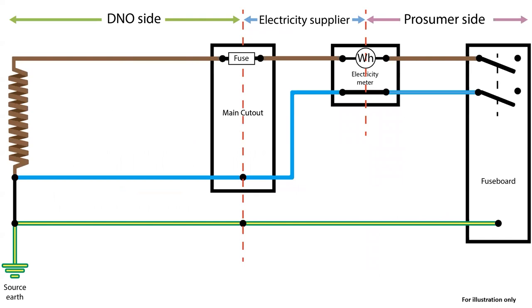With this type of cable, the means of earthing should be separate and continuous all the way back to the transformer. The on-site guide on page 13 gives a maximum external impedance ZE of 0.8 ohms, and again anything higher should be reported to the DNO.